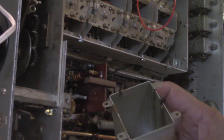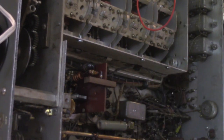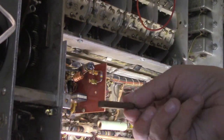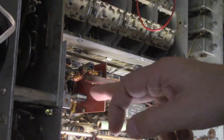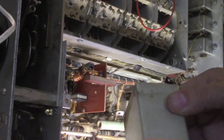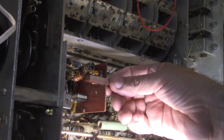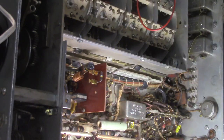There's a little can there. You just take these four screws loose and carefully slide this off. Now a little sting in the tail — there's a little phenolic spacer and it might want to fall off. It sits in there this way. It just helps space the can, probably keeps it from vibrating and becoming microphonic. You can take it out or leave it in.